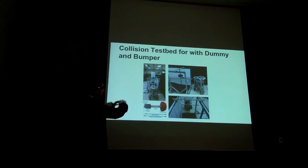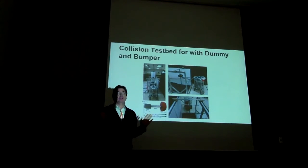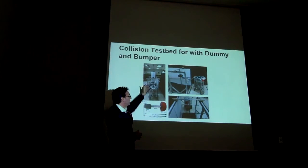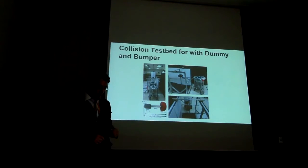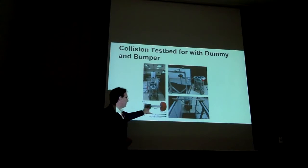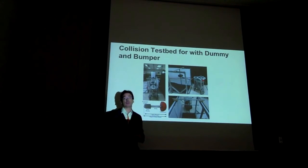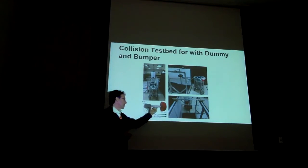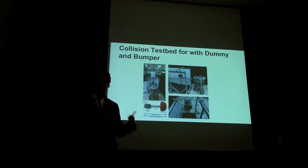So for that, we build a calibrated test bed. It consists of a pulley system with a weight falling with gravity. This is for having the least variability possible. And then we have a stick with an inertia that hits the robot with a constant acceleration or a constant force. We also experiment with different constructs for collisions, which can be either a rigid contact, we call it a rigid bumper, but we can also attach a spring. But the spring obviously is going to reduce the reaction of the mobile platform, going to reduce the timing.